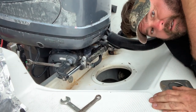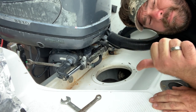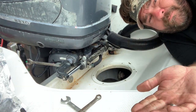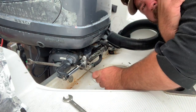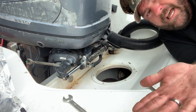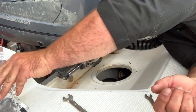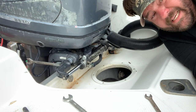Stay tuned to rip out a hydraulic steering ram seal on a SeaStar system. That's it right there — the SeaStar steering ram. It's like a hydraulic piston that goes back and forth with the hydraulic pressure regulated up at the steering helm. What's going on is right here — this is an end cap. It's like a seal that goes over the shaft and keeps the hydraulic fluid in, and it's leaking.